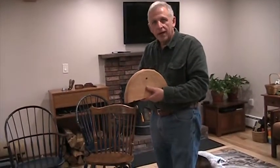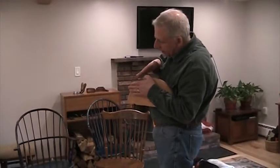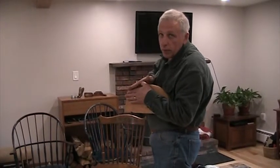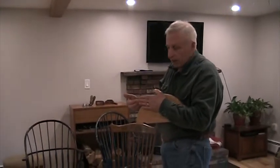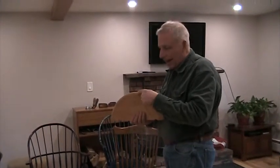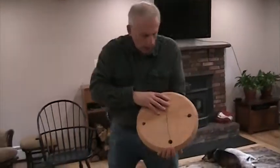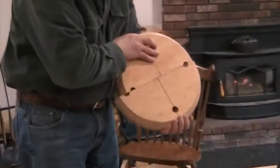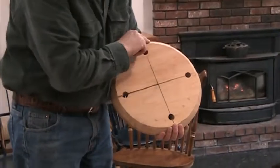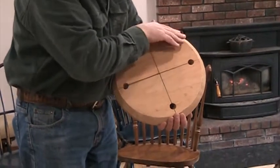It's not just when you're doing the saddle and the seat, but also when you're shaping the edges — we use hand tools for that as well. The grain fibers go this way, so the grain fiber meets this edge at an angle. If I'm shaping this way, I'm going to get a nice smooth cut. But if I go the other way, I'm going to catch those fibers and it's going to tear — I won't be able to get a good cut at all, and it's going to make all kinds of chips and maybe chip off pieces. In fact, the very top and very bottom are the worst places.